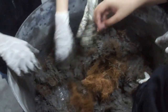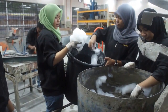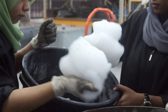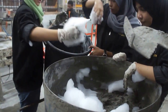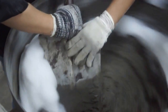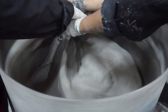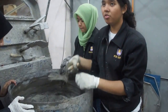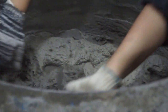This is the first step of making foam concrete — we have to save the foam and take the foam on top, because underneath the foam there is water. Now we are going to mix it by hand. The style of mixing by hand is to flip it over so that the bubbles will not pop or get damaged.